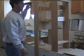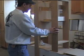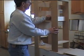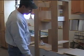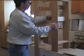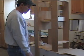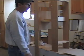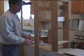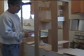At the same time I've got another kitchen scale here, and this also swings this way — the more it pushes back, the more drag is created. So I can record lift, and the foil creates drag by pushing back and I can record that on a graph. I have many different sections I've tested that are all the same size but different shapes and different flap-to-main-wing ratios.